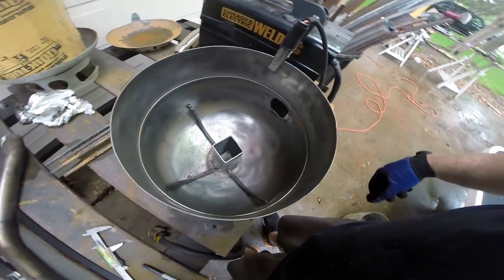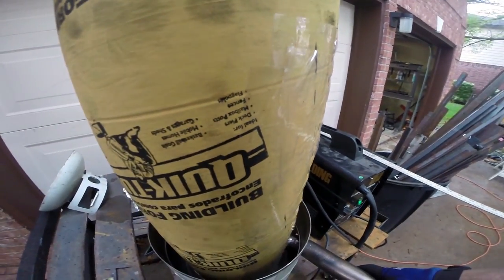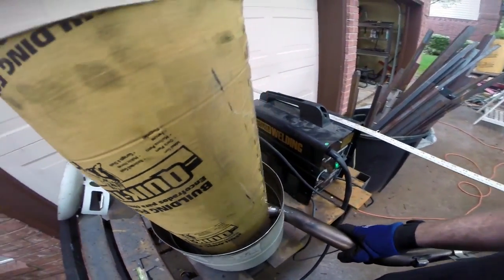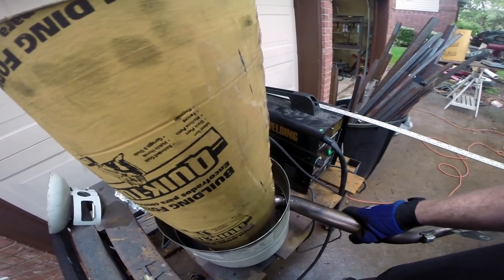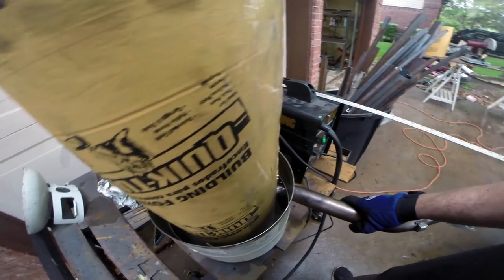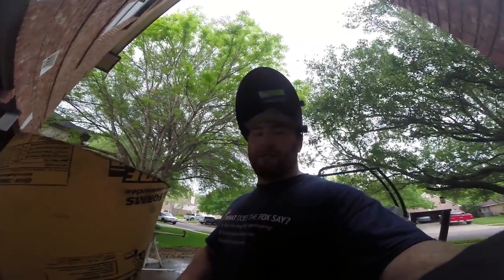The rebar is tacked in and it's not going anywhere. Next step is to put in the pipe — the distance between the tube and the inside of the propane tank needs to be one and a half inches. I'm probably gonna put the camera down and use both hands to hold it in place and tack the pipe in. Once the pipe is tacked in it's pretty much centered. It is starting to rain so this is gonna be the end of part one. Part two will be posted in a couple of weeks, and in that you'll see me finish up all the metalwork and pour all the concrete. Hope you guys have enjoyed this — it's gonna be an awesome project and we're gonna melt some aluminum.